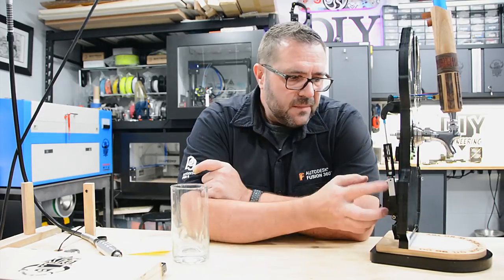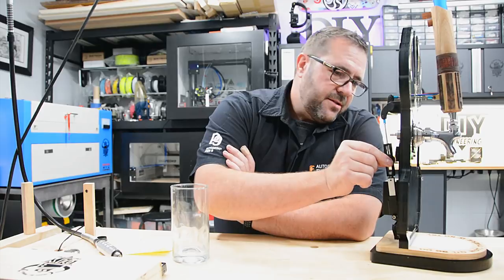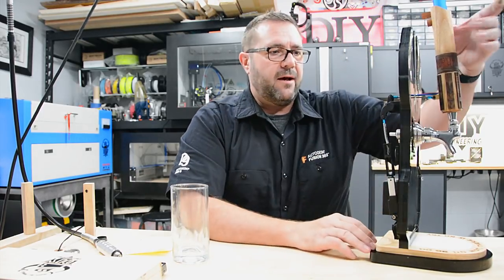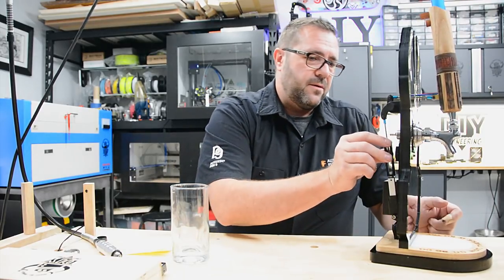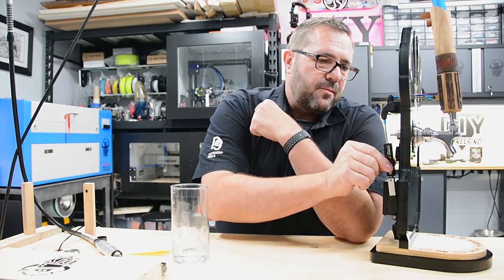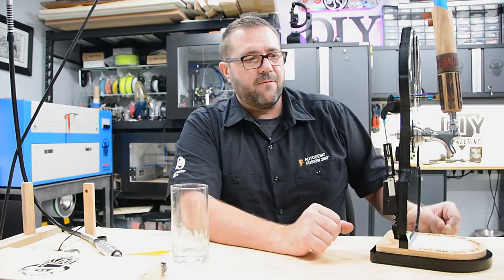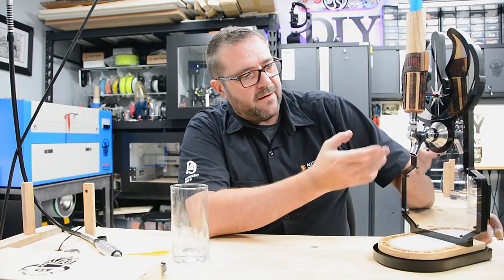On the right hand side, this little guy down here is the 30mm linear actuator. And then I had to invent this little suspension absorber thing to allow for drunk people to still pull it without breaking the linear actuator. I'm not sure if there's a name for this — I just kind of invented it to make it work for me. When the linear actuator pushes, it applies force to that and pushes it out based on the amount of force the person requesting the beer is using.